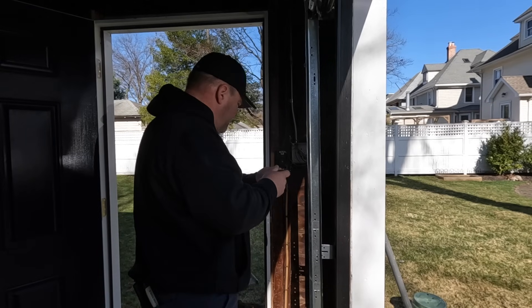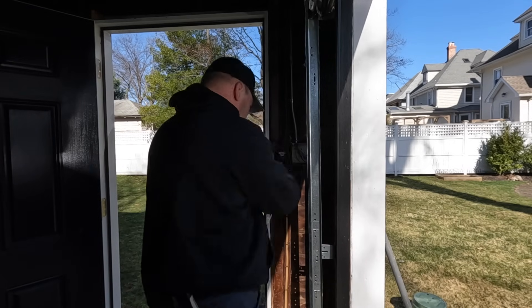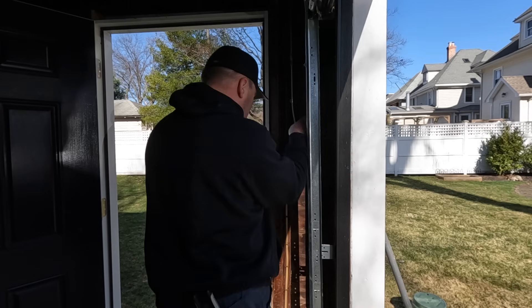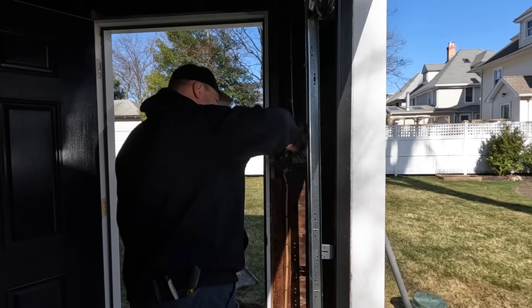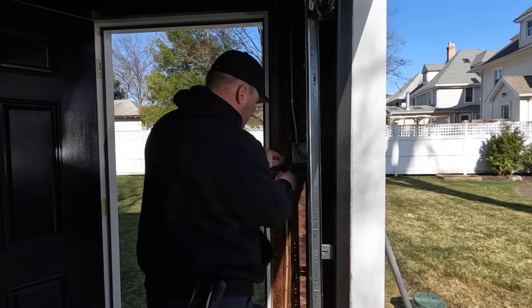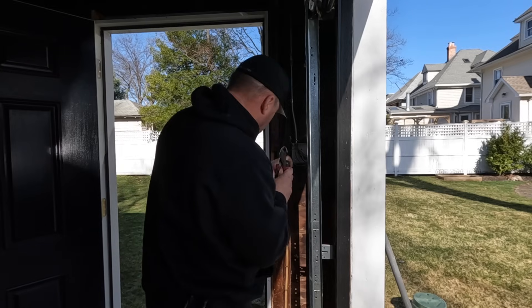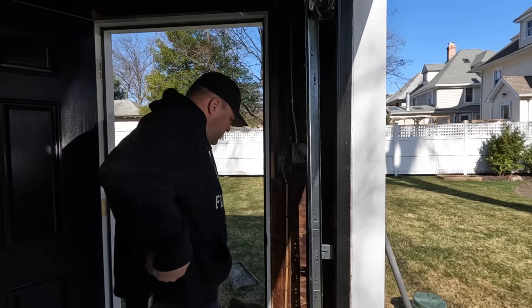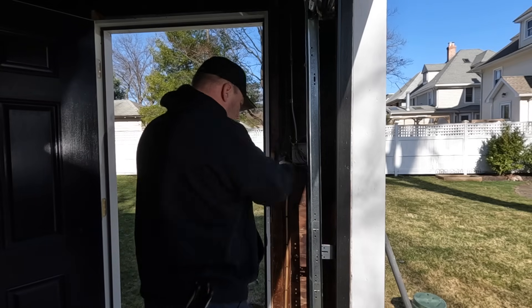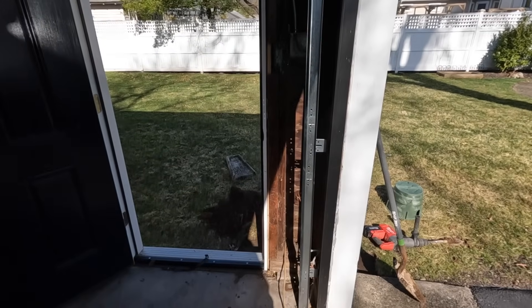The lighting level here for you to be able to see what I'm doing is just awful, and I apologize for that. What I'm doing is disconnecting the live feed that you saw on the outside of the garage, which leads up into this box. This box has a switch for one overhead light and one receptacle, and then it carries on to the back of the garage and has another receptacle. It was later rewired and connected to the new circuitry.